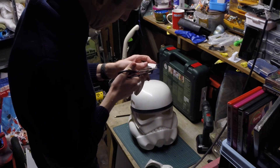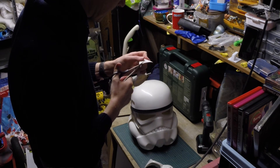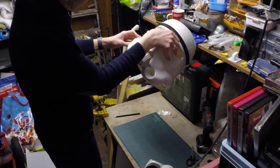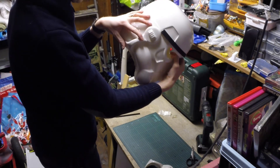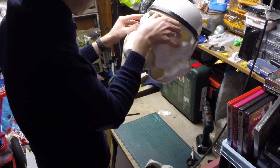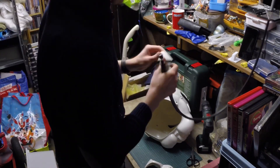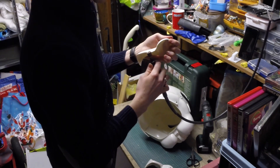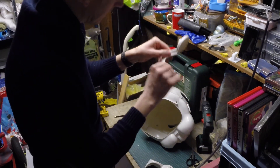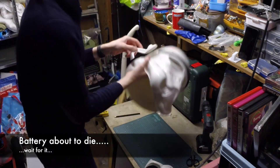I previously left quite a lot of excess along the bottom and that definitely needs to come off. So let's go ahead and do this one. You have to try and have quite a light touch with the Dremel, because the disc is spinning so quick it will end up basically heating and just melting through. So you can end up with a massive gouge if you push too hard.